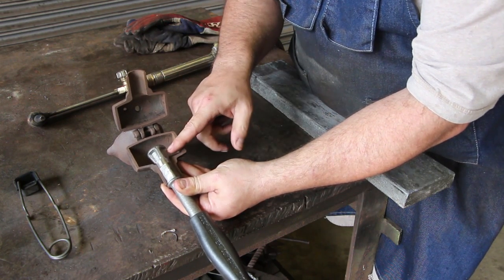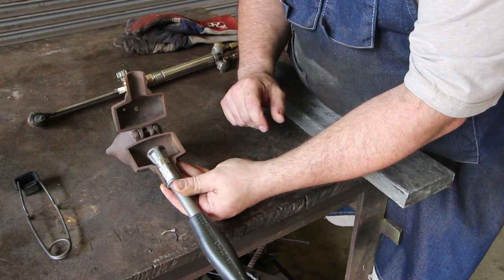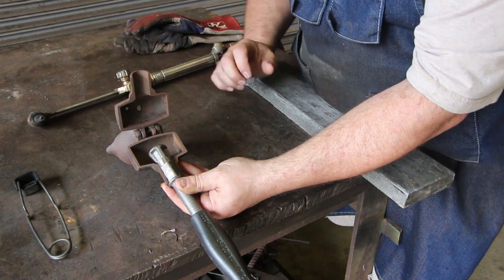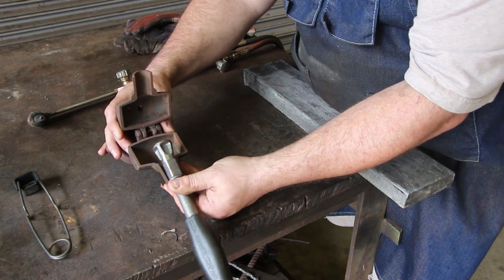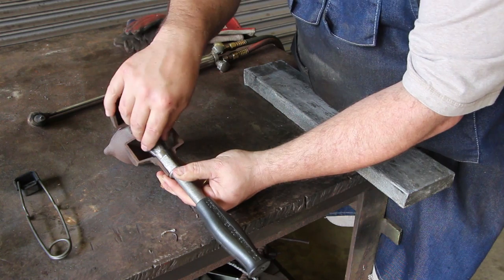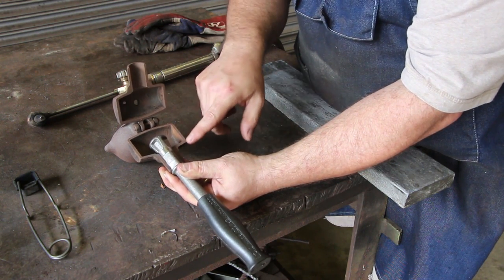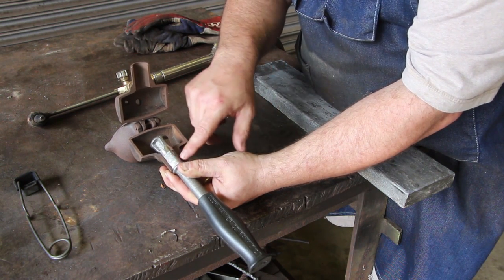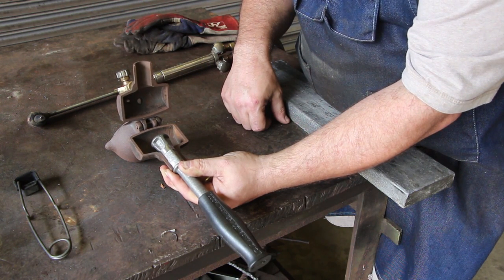It fits in. The top is at an angle there, and you've got some pockets in here, and that's to keep that head from being able to come off of the handle. It's going to be captured in there when you cast the metal around it. And also these indentions in here will keep it from rotating within that hammer head. So the top up here is very cleverly designed to do that. So anyway, this is ready to go. Again, on the mold that's really made for this handle, I think this was probably diamond shaped that this would fit into rather than round, but there's no reason why this won't work.